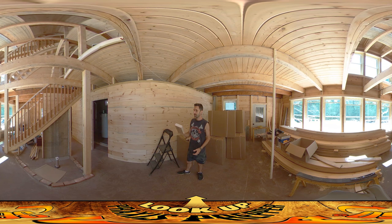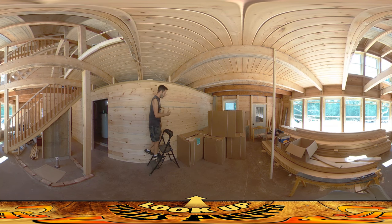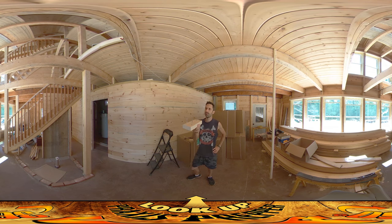I'm using entirely scrap to do it. These are bits of floorboard — all these floorboards had just about two feet of scrap at the end of each one, and I'm using these nine and one-eighth inch chunks to make nailers that are going to go right up in there. I need that so that when the boards go up, they have something to nail to. Also using scrap nails — these are either 12 or 16d nails from my giant bucket of random nails. They're all kind of bent up and everything; I've been using those to get these guys in.